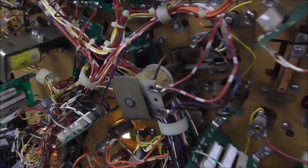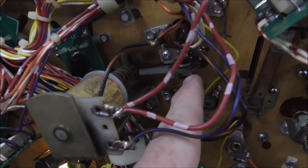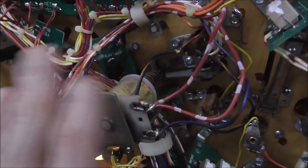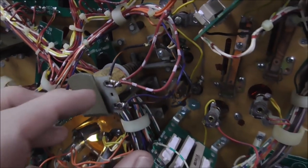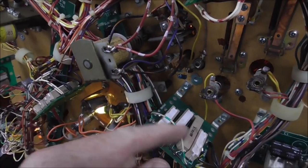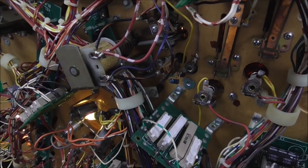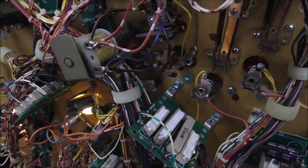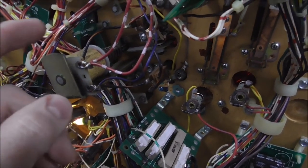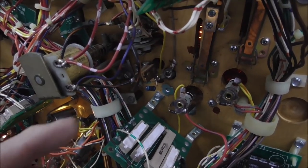So this is the right slingshot we were talking about. These are the switches that go up to the rubber. So when the ball hits that, it needs to be able to fire this really quick. So they thought that the CPU wouldn't have time to think about it and interpret the switch and then signal the coil to do it. So they made what we talked about in the previous video, special solenoids, that the switch immediately turns on the coil, basically, through a transistor on the board. The CPU doesn't have to have anything to do about it.